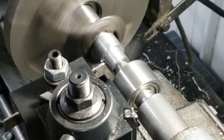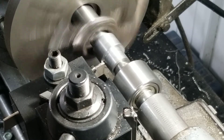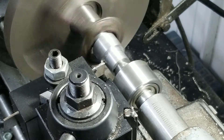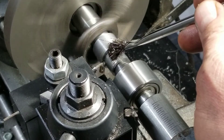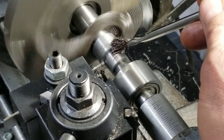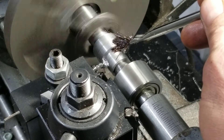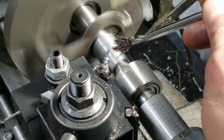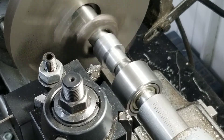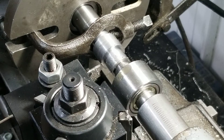The parting tool still kind of freaks me out. I've got to put a gullet in there about 36 thousandths deep. We'll just get a very light touch against that, just skimming. Lock the carriage. Yeah, I hate this part. I just like staying behind this thing anyway. That's about where we want right there — watch the dial. Wow, actually I've got to say that's the smoothest that's ever gone. Still freaks me right out, guys.